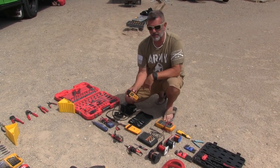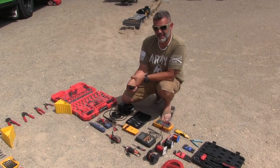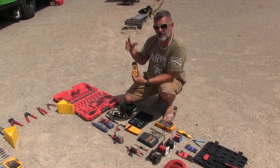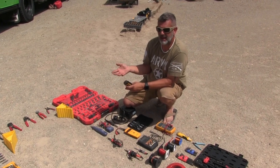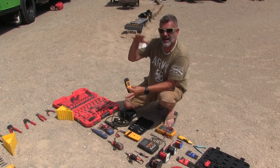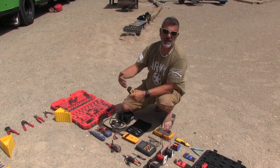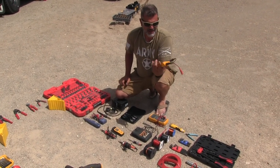We have a carbon monoxide detector here and I use it for tuning the diesel heaters. There's a back-end section in the diesel heater menus where you can change the fan speed and fuel flow. You want to adjust it so that at the high setting you're getting your lowest carbon monoxide reading, then do the same for the lowest setting. That means it's running most efficiently and you're not cleaning out soot every year.